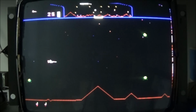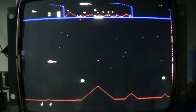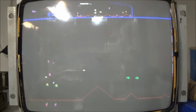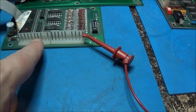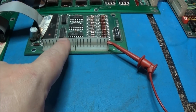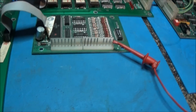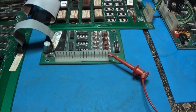Alright. I'm going to turn the lights back on. Okay, yeah. Pin 7 here, 1, 2, 3, 4, 5, 6, 7 is reverse, and it did not work. Everything else worked, but not reverse, which is a bummer. So, okay, I'm going to check the schematic out and see why reverse would not be working.